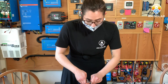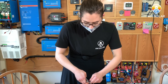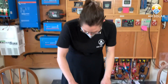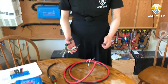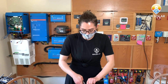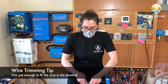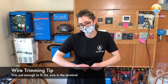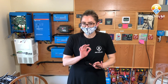Keep an eye out for the strands that are dropping onto the surface below to get a good idea of how much you're stripping. You may start to see it split a little bit here — you'll see we have just a couple pieces falling off so far. It really shouldn't take that many passes. You really shouldn't be trimming too much — you just want enough so that it can fit into the terminal, not too much to where you're compromising the connection of the cable. If you're worried about it, do it one step at a time, little by little.